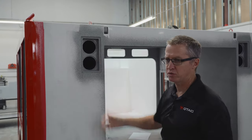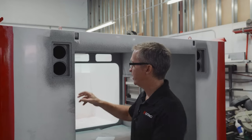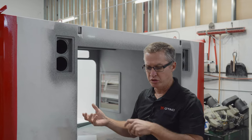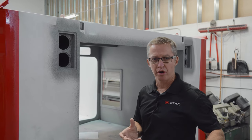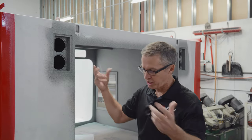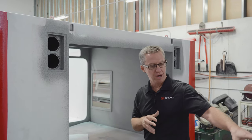Hard suction, for anybody who's watching who's not a firefighter, it's just a place to store pipe that when you get to a location where you have to draft water out of a pond or maybe a fold-a-tank at a scene, you take your pipe out, hook it together, hook it to your pump, and now you're drafting.